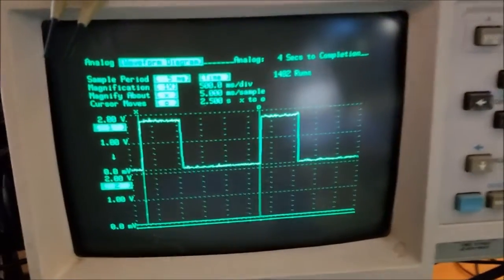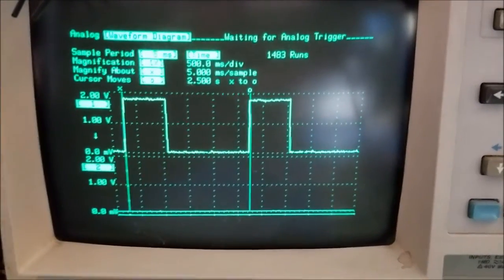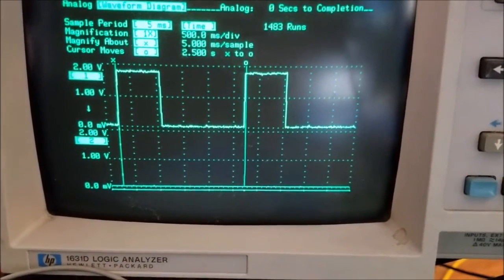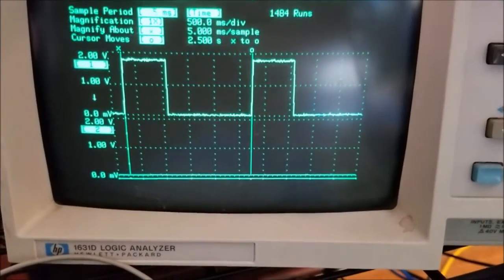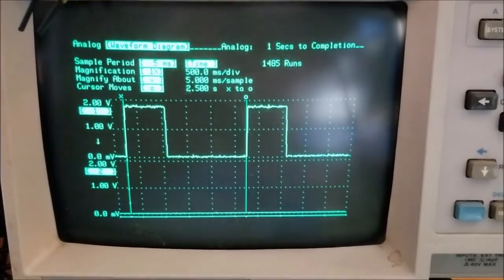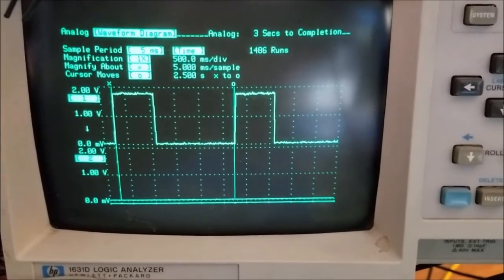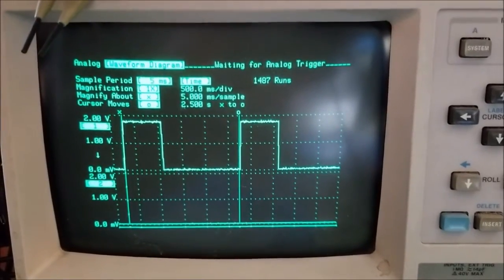Here is a trace currently running, and this is being driven by a pin off of node 8 that is being driven in sync with its drive to the RC. You notice that it drives the RC for about 580 milliseconds, and then it drives it to ground, and during that longer low period we wait for it to come down to the lower threshold. Then we send a signal across to node 708 to do the same thing, waiting for node 708 to send us back a signal to tell us to go again. So we've got a total period of this cyclic thing of 2.5 seconds.